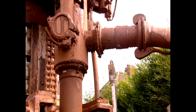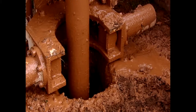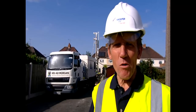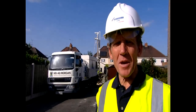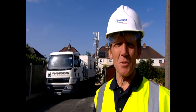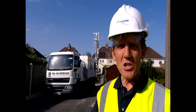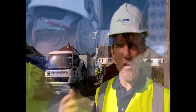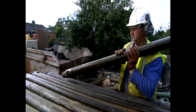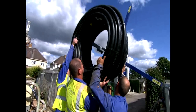The drilling is finally underway and they're going down 80 metres. You might wonder how they arrive at that magical figure of 80 metres — they're not drilling for oil or water, so they can go as deep or as shallow as they like from that point of view. But the 80 metres gives them the required length to match the heat requirement of the house. They've done an assessment on the house, found out how much heat it will need, and measured that distance per metre of ground source heat collected — that gives them the 80 metres. If it were a bigger house, they could go deeper, and these guys are telling me they can go down 800 metres.